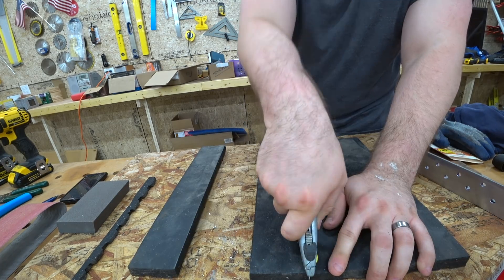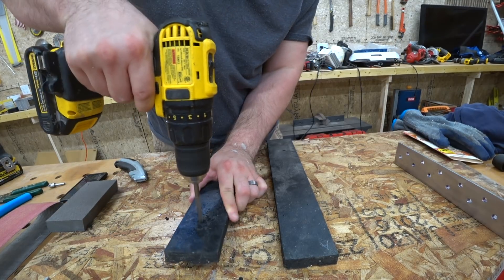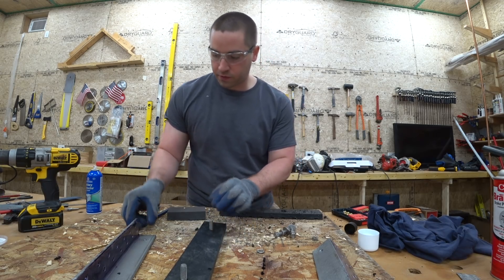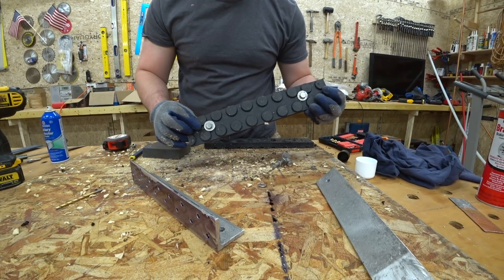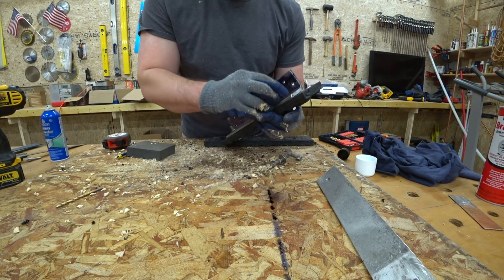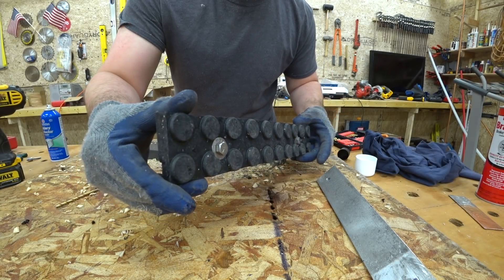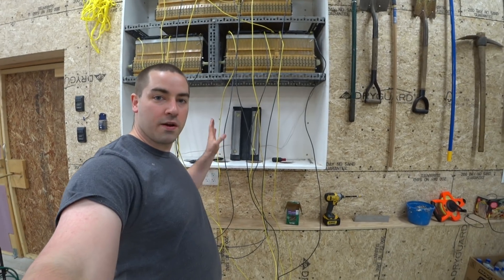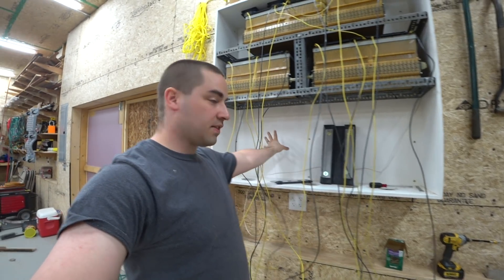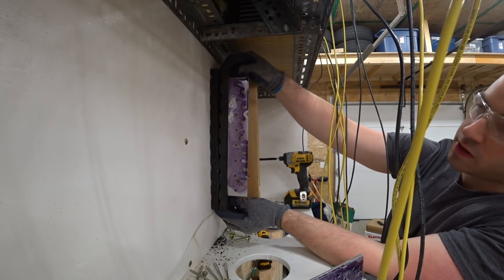There's one piece and two pieces mounted. These are stainless steel bolts from when I took apart a solar panel from the roof. I have the bolts coming up through with large washers on the back side, and I'm placing the bus bar on top, trying not to touch the shiny treated part. Those bolt heads are recessed a little bit. I want this space for the solar charge controller, then the bus bar, and the inverter over here. The bolt heads won't touch the plywood because there's another layer of rubber underneath.